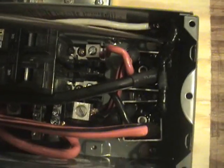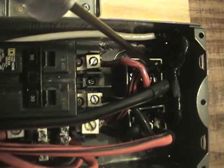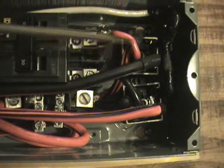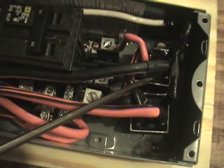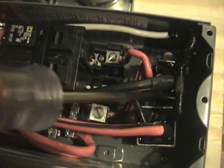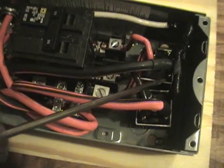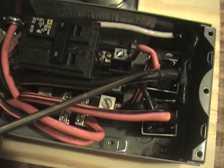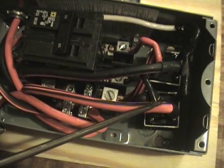The neutral AC wire is here and it's split — one goes down to this side of the AC, and splits over and comes down to this side on this other bridge. Each one of these bridge rectifiers is doing 120 volts, switching it to DC. Here and here you've got your DC coming out from each bridge.